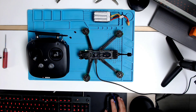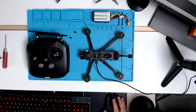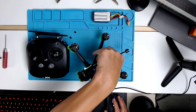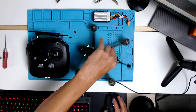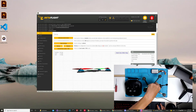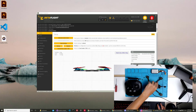One thing I like to do is calibrate this. I want to make sure that when I lean it backwards it goes backwards, and forwards forward. Before, I grabbed this and went 'yep, it's working' without actually looking at it. It's important to look at it and make sure that when you tilt it backwards it's going backwards, forwards, left, and right. So that is actually correct now. I pick up the copter and you want to tilt it forward and back, left and right. The calibration is correct.